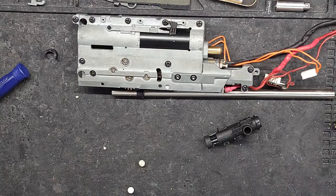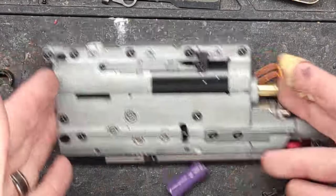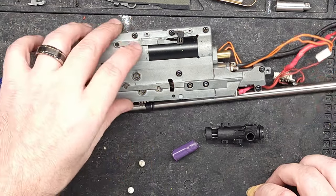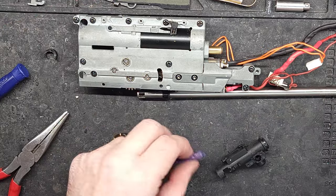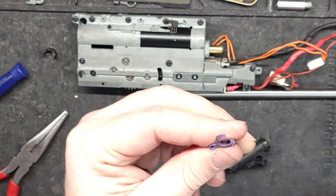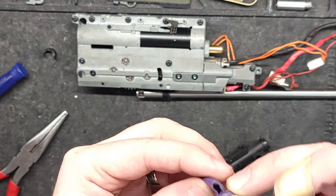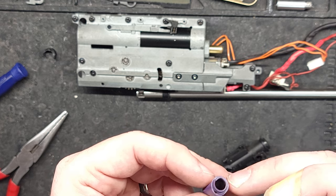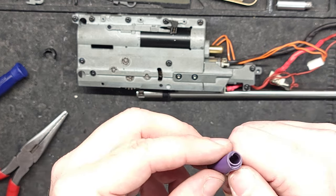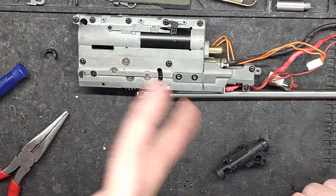Because it jammed and has been shot multiple times while jammed, I'm going to open up the gearbox and inspect the internals to make sure there's no damage to the internal parts, then put it all back together and see if she shoots. I'm going to go with a different bucking this time — I think the original was a little too soft and that's why it tore. It must have folded over and the BB tried to pull it down the barrel, and then multiple shots finished it off.